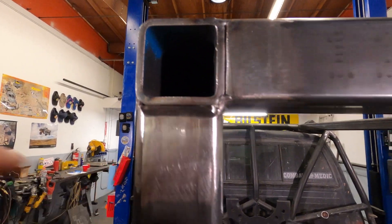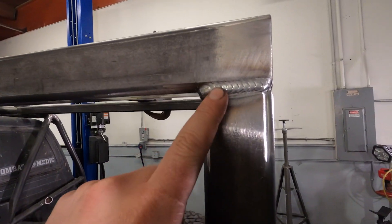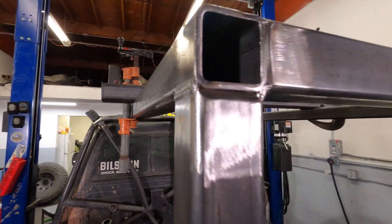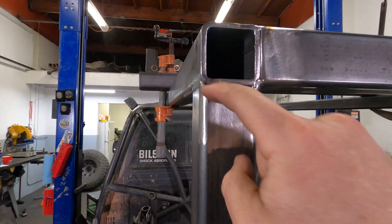You can see how anal I am about cleaning this stuff. I'll go in with probably two different wire wheels, and then right now I have acetone and I'm going to wipe it all down before I do welds. That's because you can end up with welds that look totally fine on the outside but if you cut into them they'll be porous and weak, or you won't get the penetration you wanted because there's some contamination in there that leaks out into it once it gets hot. It's the inside that matters.